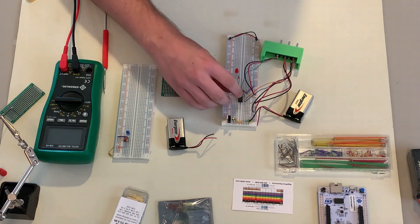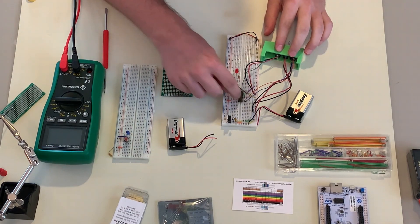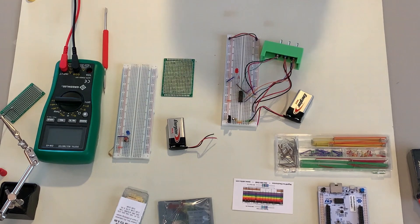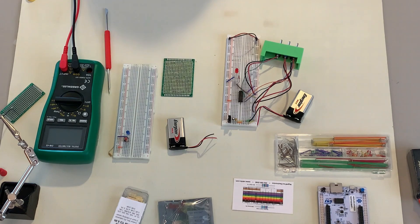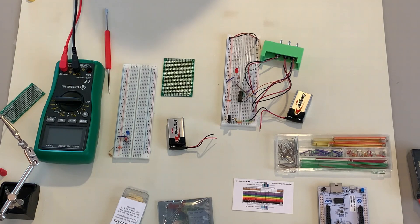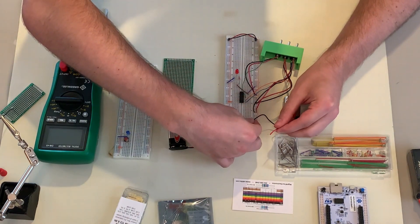This chip is a four-input AND gate. I've pulled one of the pins high so it effectively functions as a three-input AND gate, since I only have three switches. The switches are connected into the input pins of the AND gate, voltage and ground are connected, and then there's a signal going to the LED. If you don't know the pinout, you can look up the number and letter combination printed on the chip to find the datasheet, which tells you the pinout, maximum voltage, and desired operating voltage.